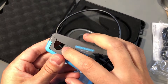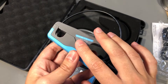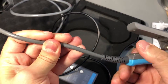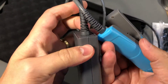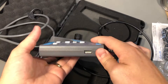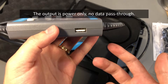The opening here is about 12mm wide, so you will be able to clip this onto wires no bigger than 12mm in diameter, which I think covers 99% of use cases. The grey wire is definitely shielded wire and feels very high quality, with strain relief on both ends. Then there is the BNC cable that connects to your oscilloscope, once again with strain relief, and this is where the power comes in through the USB connector. You also get an output that you can use to power a secondary accessory.